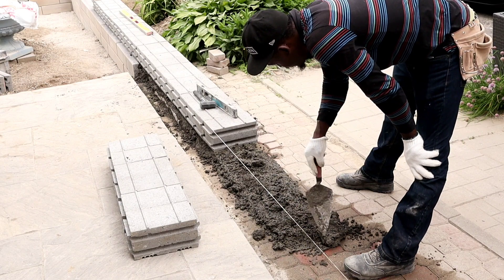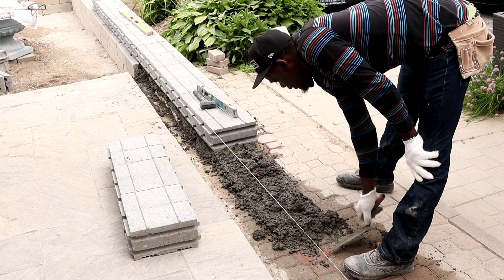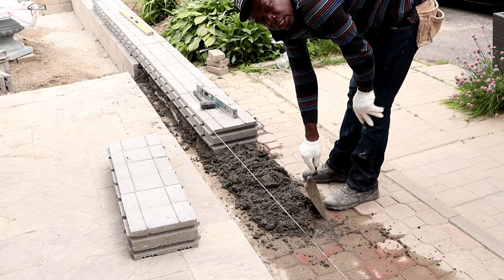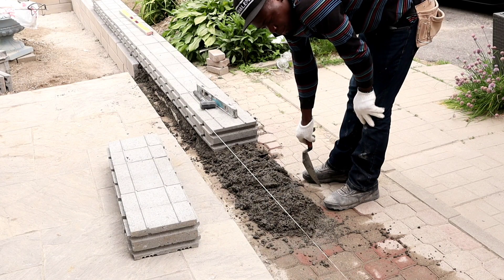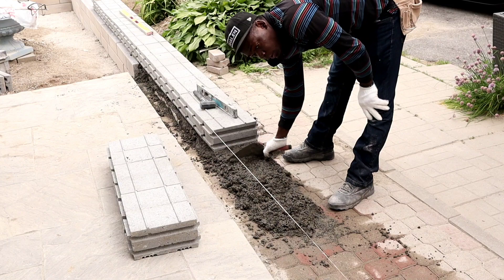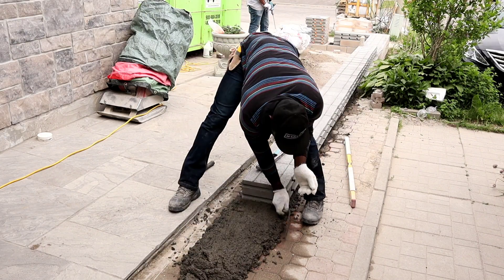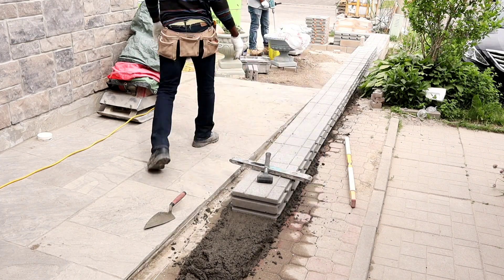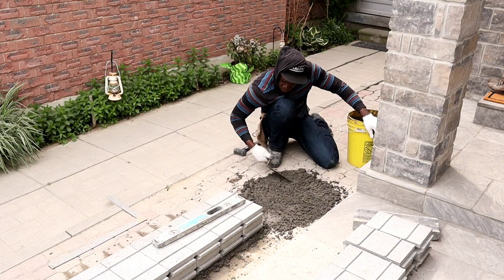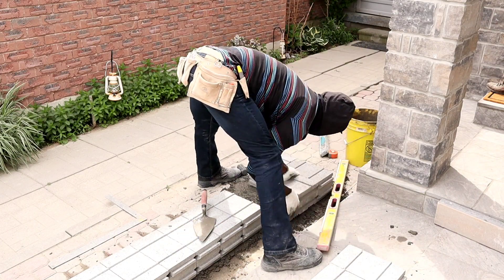I catch the level from the floor — I put some mortar to level it off because there's existing interlock here. In my opinion, if there's an easier way and you'd do this differently, leave a comment and let me know. But I think putting the mortar on top of the interlock to catch the level for your first course is the easiest way. So there I'm setting up for my column — I'm putting a column right here on top, and you want to make sure your wall is level with the side wall as well.